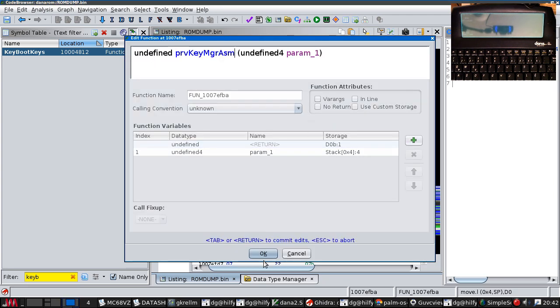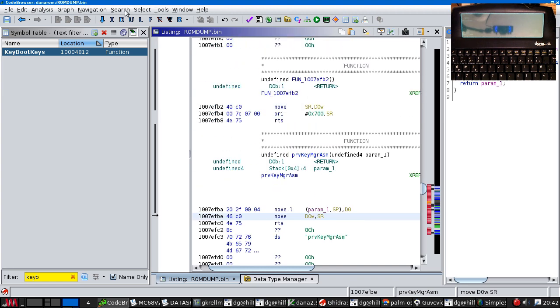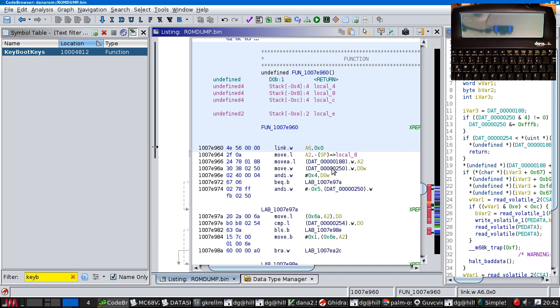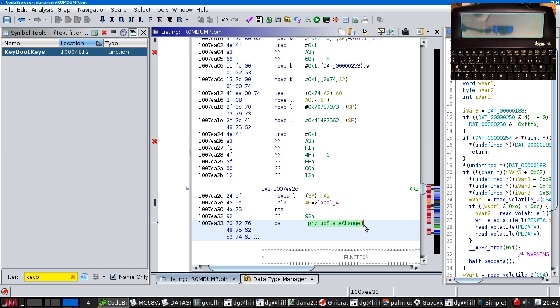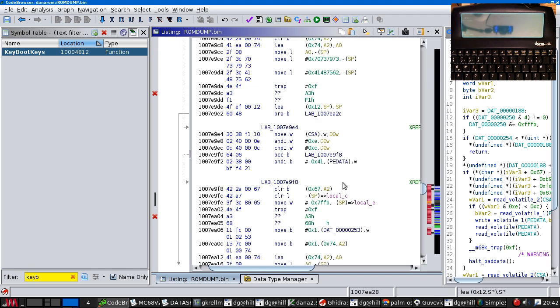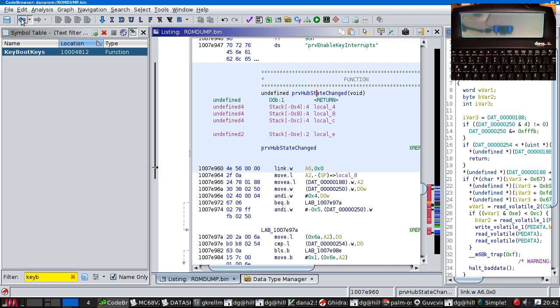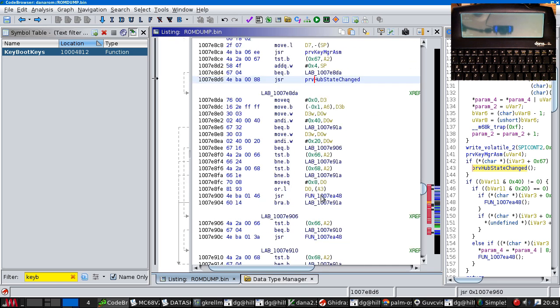Key manager assemble. Assembly. Put the parameter in D0. Move D0 to SR. This is probably changing the interrupt mask bit. This one is hub state changed. And I've no idea what PalmOS means by a hub. That's not a USB hub. This one...